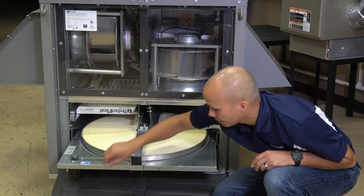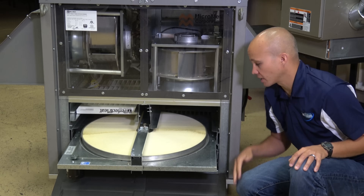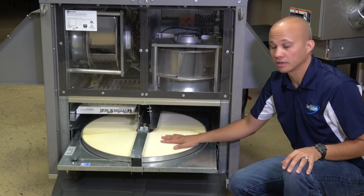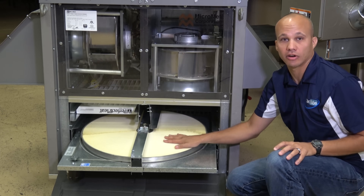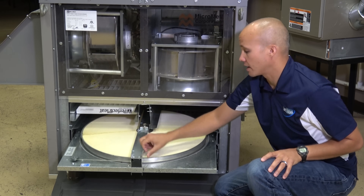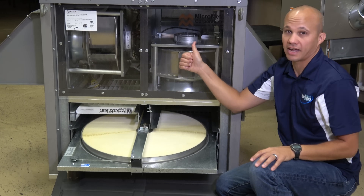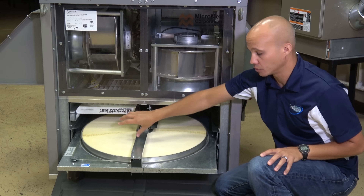There's a small motor down here that drives a belt, and that belt turns this wheel. Air comes up from inside the building and goes to the heat exchanger and gives up its energy — heat goes from hot to cold, moisture goes from high moisture to low moisture. So if it is summertime and we have hot, humid air coming in, that means we have cool, drier air leaving the building. The moisture and heat come in here and get transferred on this heat exchanger as it spins and exhausts back out.